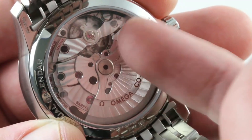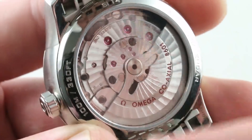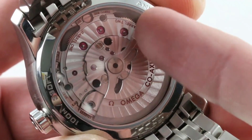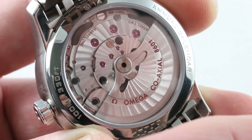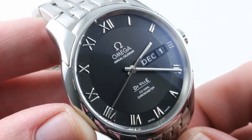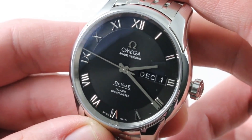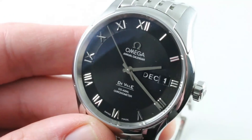Free-sprung balance with a full balance bridge for shock resistance, silicon hairspring for anti-magnetism — all of this 100 meters water resistant. You can see it's a handsome movement with spiral arabesque Côtes de Genève and blackened rather than universally blued or polished screws. You can also see the twin mainspring barrels in this 39-jewel movement — robustly sophisticated, somewhat thick, but tough as a result. The thicker a movement in general, the tougher it is, which is why this full steel 100-meter automatic is rightly a sports watch. It's a dress watch too — it's both, it's an all-arounder. It's the equivalent of a Ducati monster for your wrist. See it and ride the wave on The Watch Box.